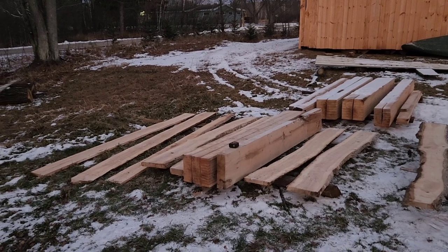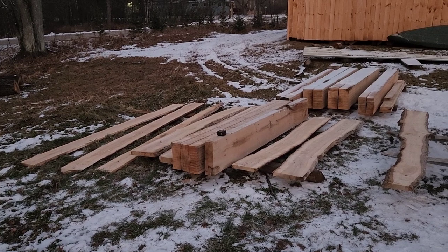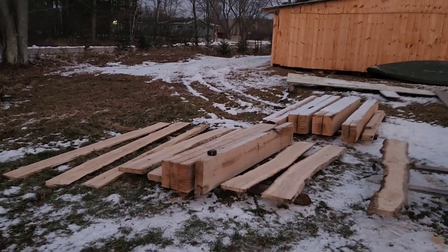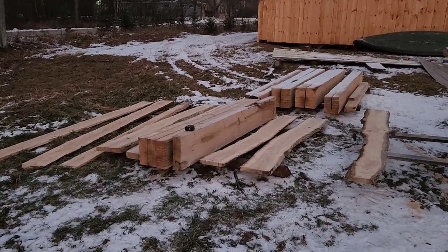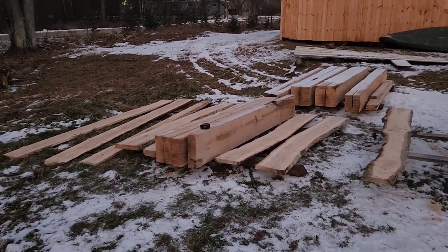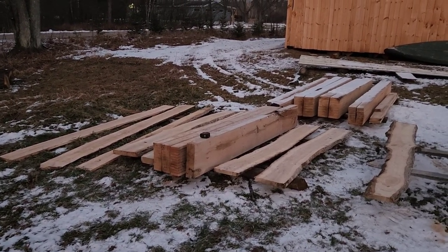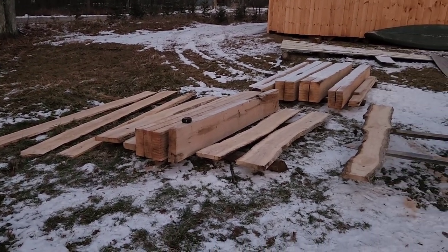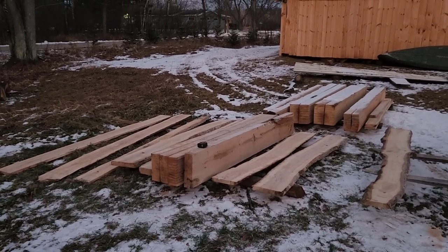So folks, I hope this was beneficial and helpful for you, but I'm very impressed with the quality of the blade and how well it ran. Now, when I deem a blade is dull, it's dependent upon how I see it. And the way I see it is, if the set decreases below 18 thousandths, if it no longer scrapes my nail, and if the sawdust is not shooting out in a stream, if it's just floating off. And that's what we saw on this final log as we were cutting. I was hoping to get one more, but that's really all I could push her.